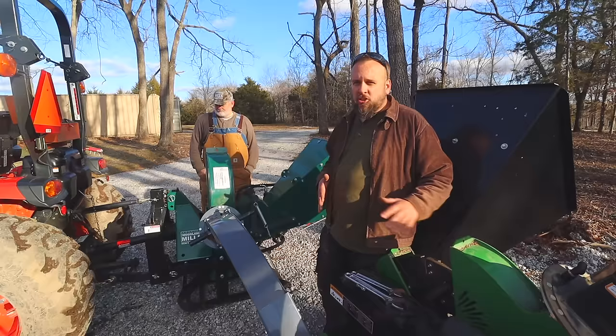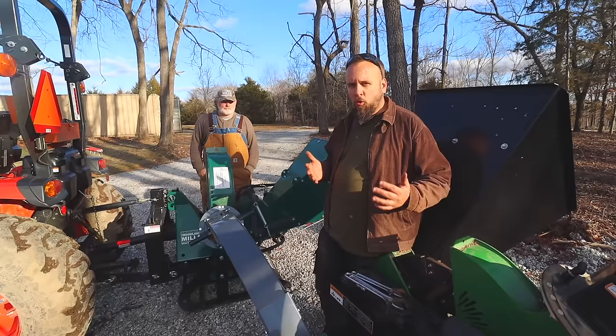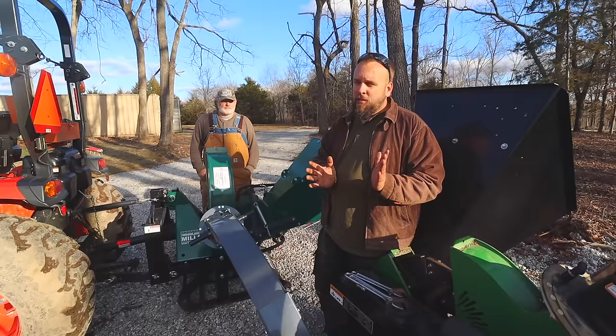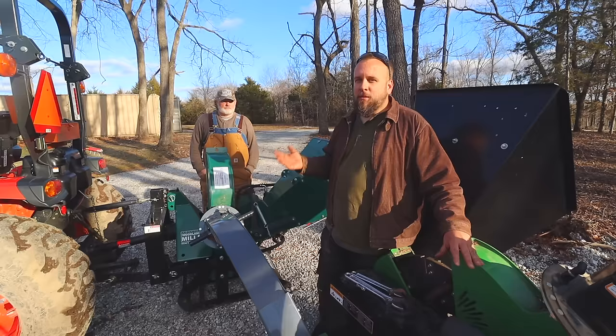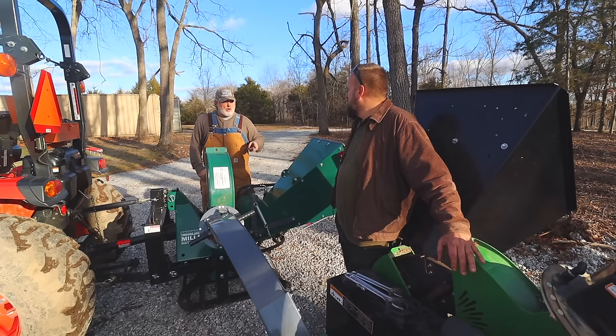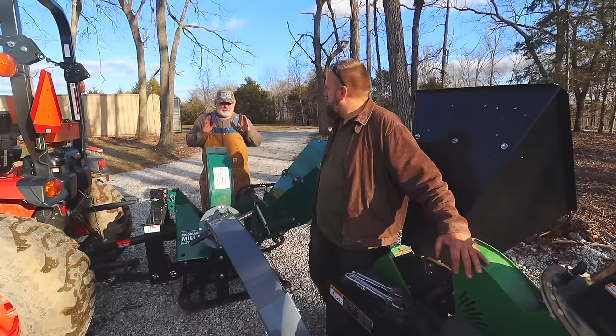Just some general overall thoughts: if you're getting ready to buy a wood chipper, keep in mind it's more work than you might originally think. It's time consuming — you have to cut your branches down until they don't have many Y's in them, because the Y's tend to get hung up. It's a good tool to have and I'm glad I have one, but just keep in mind it's actually a lot of work. The Woodland Mills has a six-by-eight-inch feed box, but like Brock was saying, when you put a branch in that has a Y on it, they will hang every time. If it's a straight piece of log or board, it works okay.